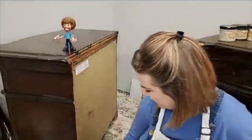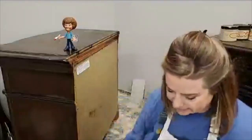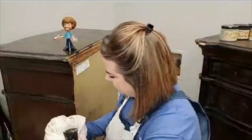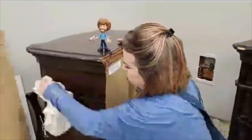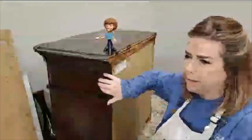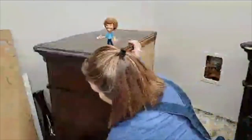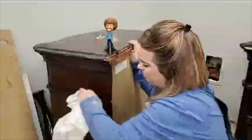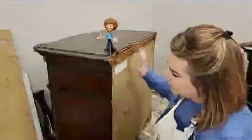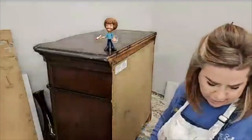Once your piece is all scuff sanded, make sure you tack back off your dust and dust the piece. Now this is ready to accept paint — I've given a little bit of bite to the surface, just de-glossed it and took the gloss away from the finish. Then you can skip the Slick Stick step. Scuff sanding is super functional. If you prefer Slick Stick, go for it — it's not gonna hurt anything — but a scuff sand works great too.